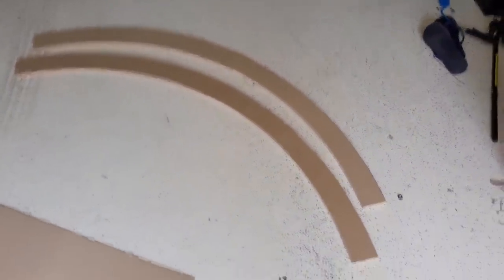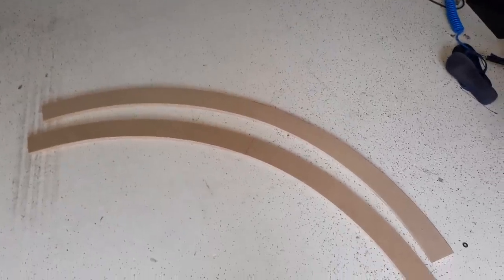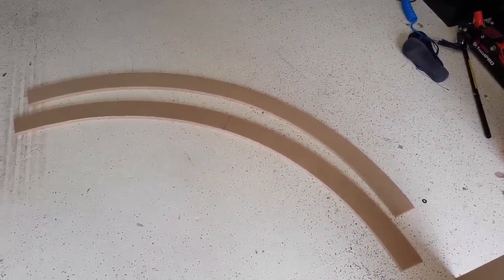So all they do is, there's a frame on the end, a post in the center, a post there, top gets glued to it. Here's a photo of what that looks like. And then the skin, which is just thin 3mm MDF and bends really easily, gets bolt screwed to it in a few positions, but mostly just glued and clamped until it dries.